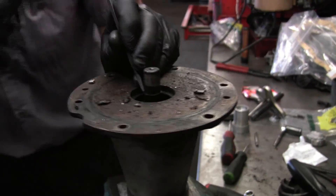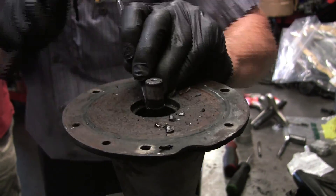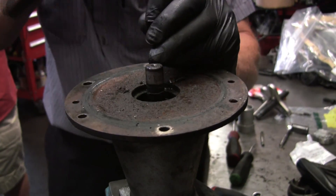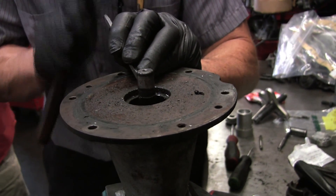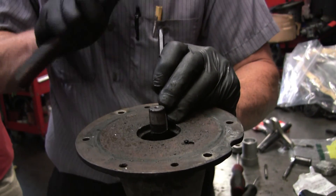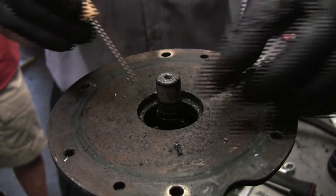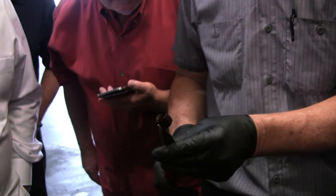As you can see, it's really thin tin — same kind of metal, but it's wrapped around that shaft and it has to come off. You cannot get this thing apart otherwise. A few nicks on the shaft because it's a press fit — I will put sealer on it. The pressure on this is not very significant, maybe 16 pounds max. Once it starts peeling, once I get it all the way down to its limit — see how it is now? There you go. It was corrosion mostly — it's pressed on, but it was corroded on there too.